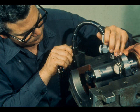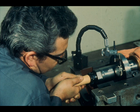Once the workman is sure the rotating assembly is positioned correctly, he prepares to check the thrust collar for runout. As you can see, he is adjusting the foot of the dial indicator on the face of the collar. This task will usually require two workmen. One workman applies pressure to the end of the rotating assembly, keeping the thrust collar in contact with the thrust shoes and watches the dial indicator, while another workman turns the shaft from the coupling end. There should be no runout here. If there is, the collar will have to be removed and the cause of the runout corrected.